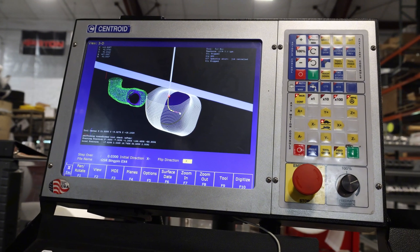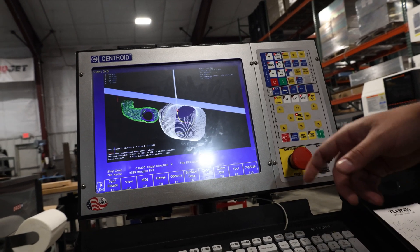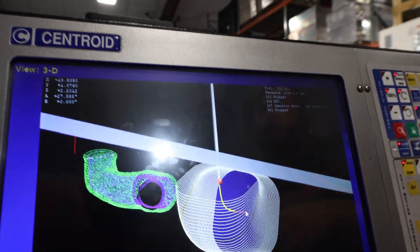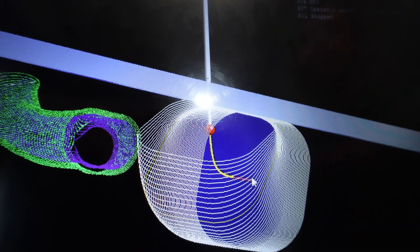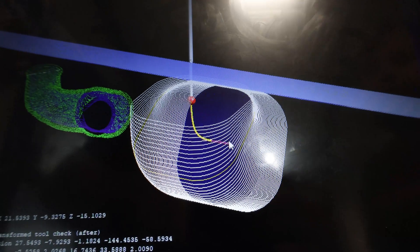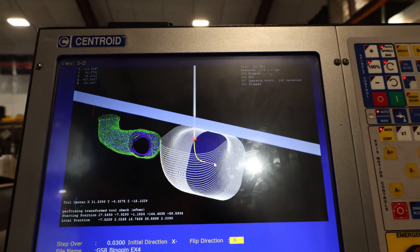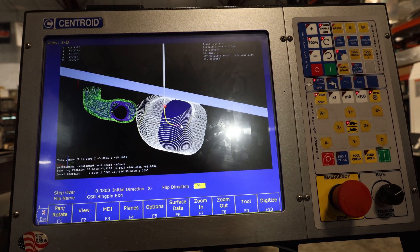This is the first step of our digitizing process. What this little probe is going to do is take little slices out of the port and give us a map of lines that represents the shape of our port. Then we're going to make surfaces and actually a solid model off of that in the end. It's going to touch a bunch of points around the port that Josh and Jackson made by hand, and we'll pick it up, put it in a computer, and be able to cut it with the CNC.